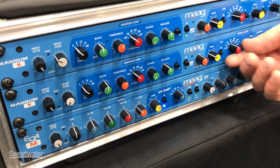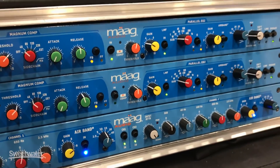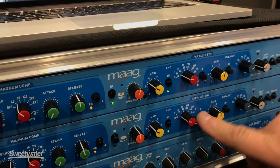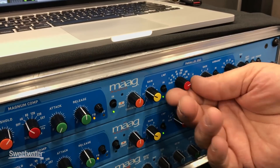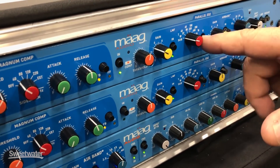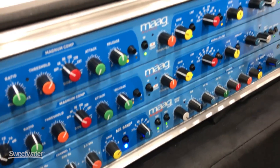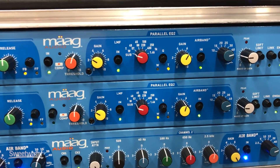I can take the low frequency bands — I can go with the sub, which is a wide band of two octaves. I can also go with the tight band, which is one octave. The lower numbers give you all the values in the wide band, clear up to 1.4K, which is a two-octave bandpass. Then I can switch to the tight band, which gives me all the numbers on top so I can zero in on specific frequencies. It's a boost-only EQ. I've also got an air band starting at 10K, moving out to 40K, where I can open the top end back up with the original signal — as much as I want.